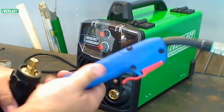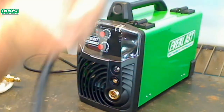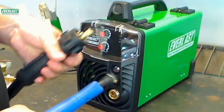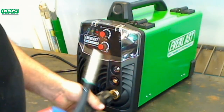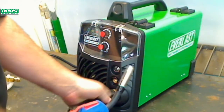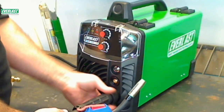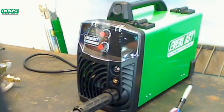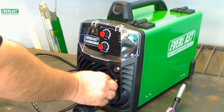Completing the required connections for the unit to operate is quite simple, thanks to the quick-connect fittings on both the torch and the work clamp. To complete the connection on the torch, simply line up the Euro quick-connector so that all the parts mate together with the socket. Give a slight push to engage the torch and snug the plastic collar down, finger-tight only. For the work clamp connection, simply line up the locating tab on the connector, insert, and twist until it is locked in.